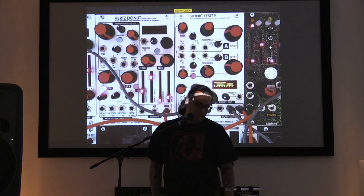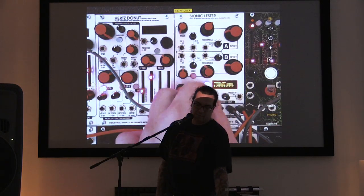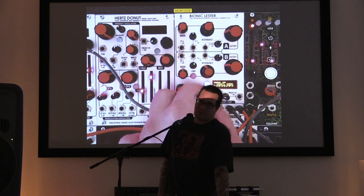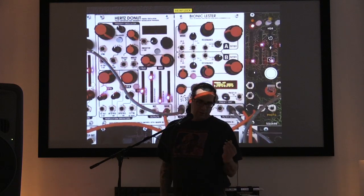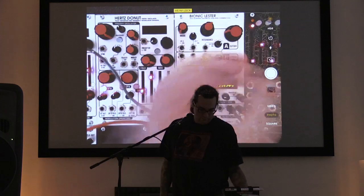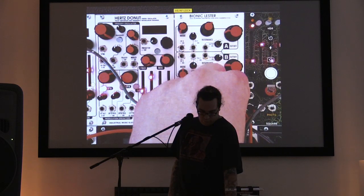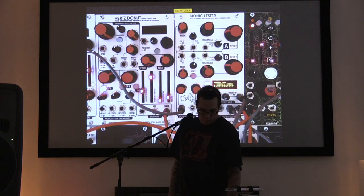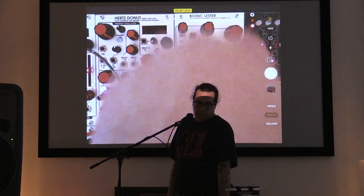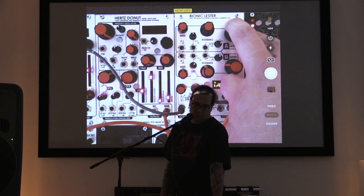Morph mode works a little differently. When you're in morph mode, it takes over the control of most of the knobs on the panel. You still select the bass preset, but all your action is going to come from the control voltage that you put into it. Then you click it again to exit out of preset mode, and you're back where you started with your manual control.